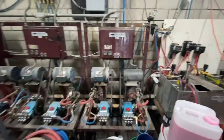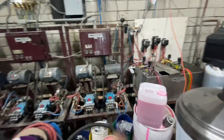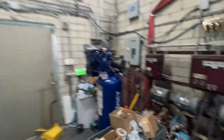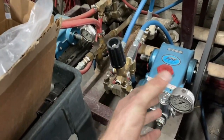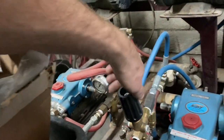It just got even louder because you can hear the motor. This is bay number five — someone's using the high-pressure water, the high-pressure soap, or the wax. These high-pressure water tanks have a pipe going from there down here. It's kind of hard to see it all and hard to explain, but the water runs through here, up through here, through the filter, all the way through here, through the pump, up here, into the blue hose, and then up into the bays. This adjusts how much pressure comes out of the gun in the bay — you can see the gauge here. Mine's just over 1,100 PSI, which is pretty powerful. Customers like it at that strength — all you do is turn this to adjust how powerful you want it.